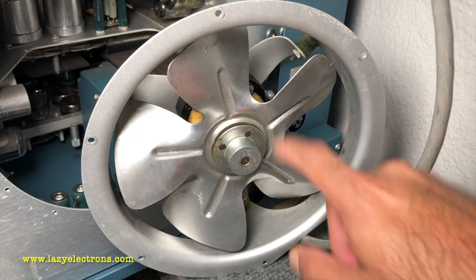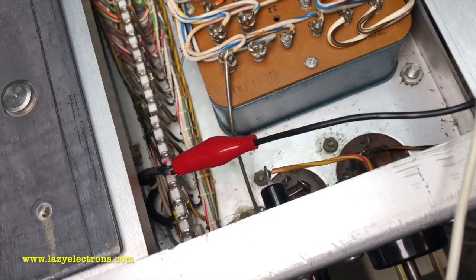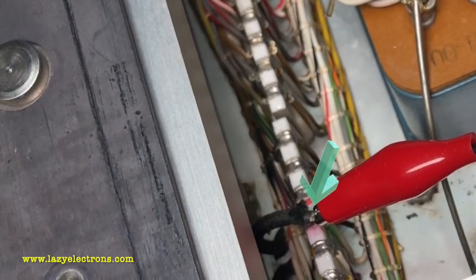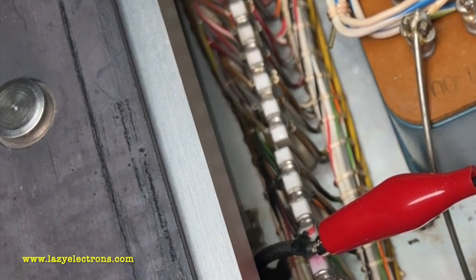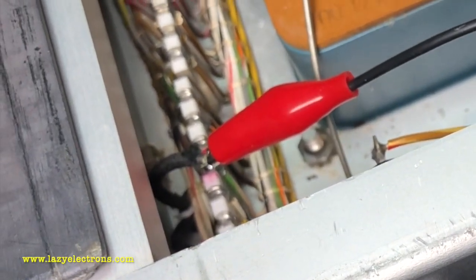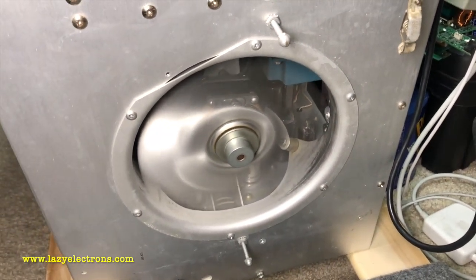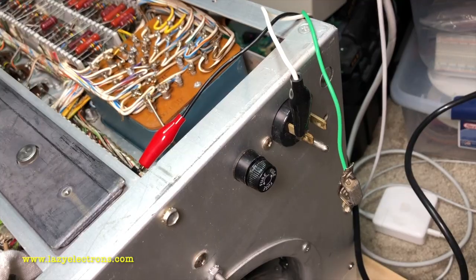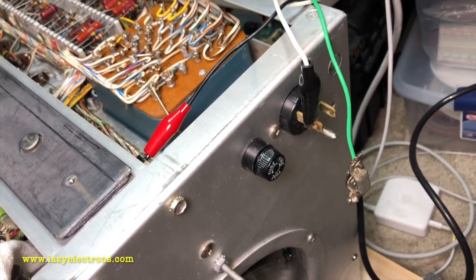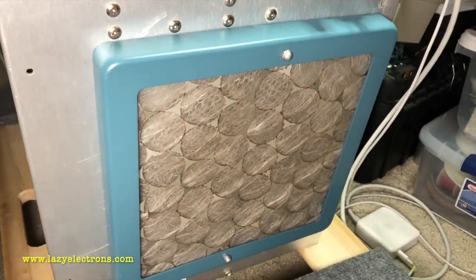This is about a minute after applying the oil — it's all good. I've disconnected one terminal from the fan connector wired to the ceramic strip, and the other is plugged directly into the power cord so power doesn't reach anything else other than the fan. It seems to be okay. A quick point: this power is coming from a variac, so I didn't power it up directly to the line. That's the fan assembly completely installed with the filter and bezel.